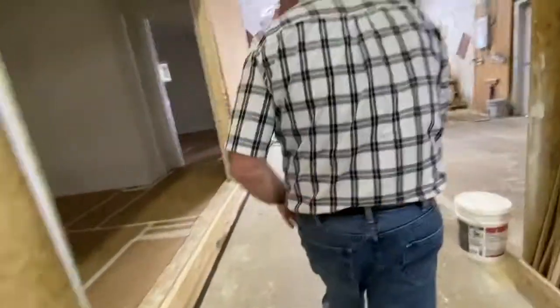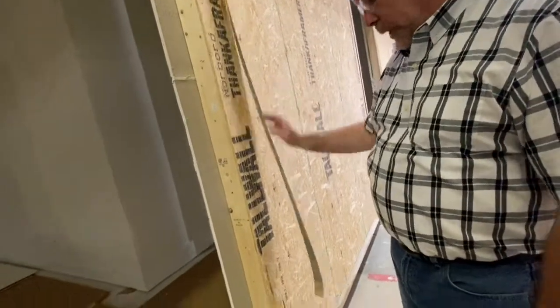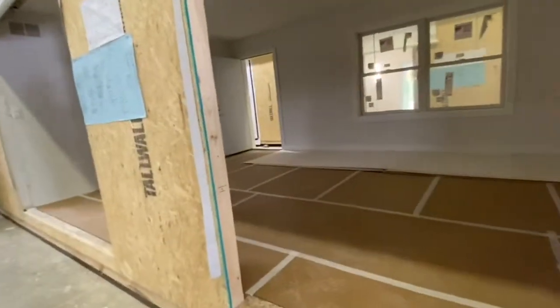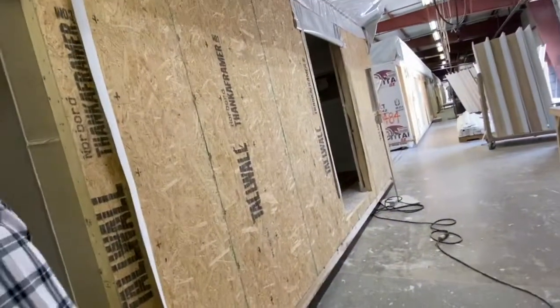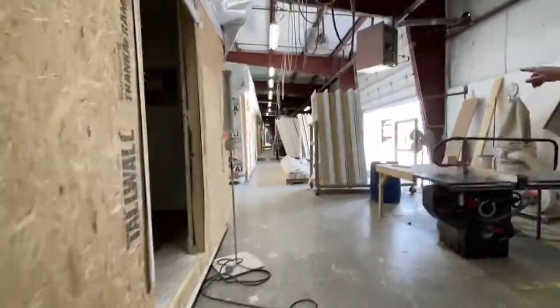And we protect all the floors. Now, what is this for? When we travel, we'll drop those down, and we fasten these nylon strips so no rain can get in the opening. Right, because there's going to be another room here. That's a temporary wall. So this will go into another room when the other half is set. Okay, so it's just to drop it down and protect it. We cover the roof with an 8.5 mil plastic, and then we put a tarp over the top of that.